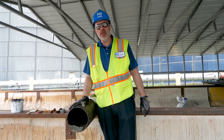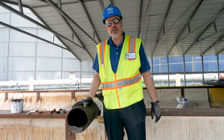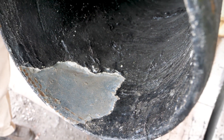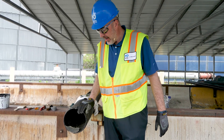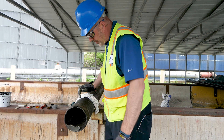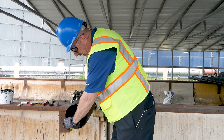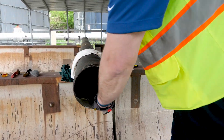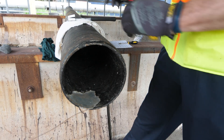We'll find from time to time that pipe that's been on a job site can become damaged. We do have the ability to repair that cement lining. The procedure is pretty straightforward. We're going to start by determining if there is any loose cement lining that we need to tap out. We want to have a good solid base to replace that cement lining with.